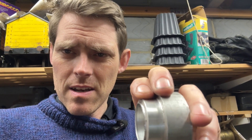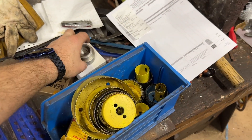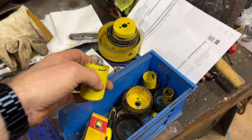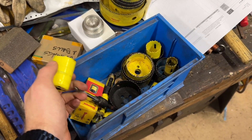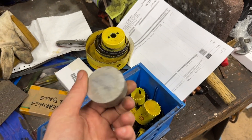He gave me a call and said what can I do, and I said it needs a little sleeve to hold them. I had a look through my materials, went in the cupboard and found a bit of ally — bigger than it needs to be in fact. That off-cut's turned diameter is actually the diameter that the bore wants to be, so there's a lot of material to take out. My theory was to save some material by using one of these hole saws — 38 mil, or maybe 35 — because 40 mil is the bore. But I can't find the holder for this size, so I'd have to machine it all away.